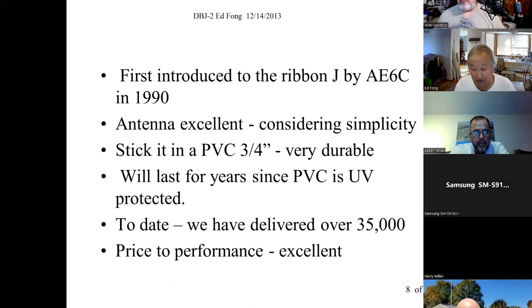The way I chose it, I was more simplistic than that. I chose a bunch of materials and accidentally picked this, and thought the best thing to do is let's cut a piece and put it in a microwave oven. This is how I tested it. 5 minutes, if it gets hot, it's no good, right? That means it's absorbing heat. I had this stuff 5 minutes and it didn't change temperature, so I would conclude that that's probably pretty good. Then what we did do is we tested RF-wise.